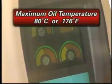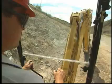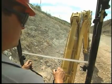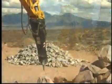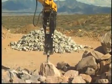Do not operate the hammer with an oil temperature above 80 degrees Celsius or 176 degrees Fahrenheit. Continued operation above this temperature will result in reduced seal life and the possibility of internal damage due to reduced oil viscosity. Stop the hammer as soon as the material fractures and do not allow the hammer to fall through